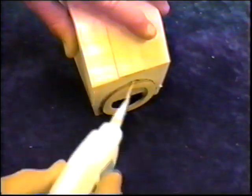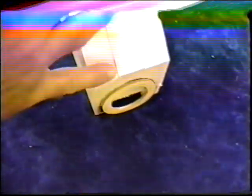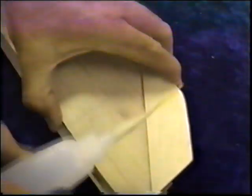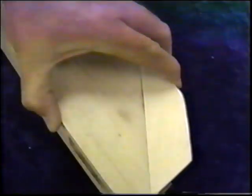I just want to tack this in position. Usually one dot is all you need. I want one dot up around the sheeting, of course. Now, even if the edge right now isn't exactly perfect like it is here, we're going to fill that in with 64th plywood, and then we'll use the actual composite cowl to sand the fuselage in. So if anything, we'll leave a little extra meat on the fuselage and get the cowl contours the way we want them.